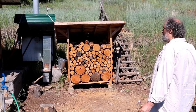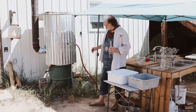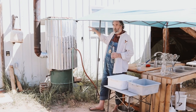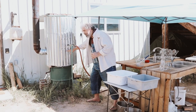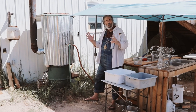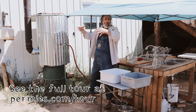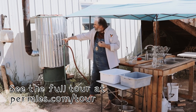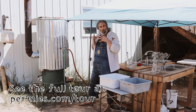I'd like to transition towards something like the unpressurized water heater we have down there. Basically it's like a giant pot that's open at the top. Down here you can see the wood feed for the rocket bit. There's a riser that comes up, and hot gases from the burn hit the bottom of that giant pot. It's insulated on the outside so the hot gases can go around the entire container of water and then come out through a stratification chamber element, extracting heat from low so the hottest gases stay inside and continue to heat the water.